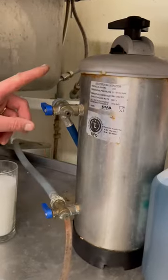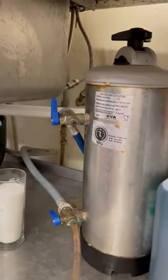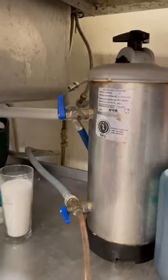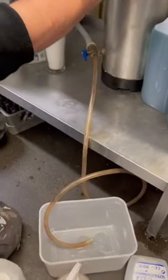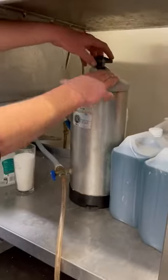To turn the water off, we turn this to 12 o'clock — that stops the water. We turn the bottom tap around to 3 o'clock to drain the water. It's got a restrictor in it so it'll come out very slow. Then we take the lid of the water softener off.